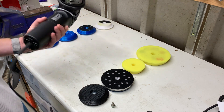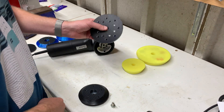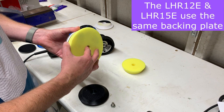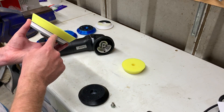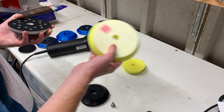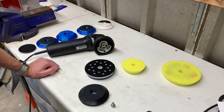About three or four months ago I picked up this Rupes polisher LHRI 12E. That comes as standard with a five inch backing plate, and this is the pad that fits that. It might be five inches, but by the time you're looking at the face there, you're at six inches. What that basically means is if you've got any small areas of the car or panels, it can be a little bit difficult to get in there with the pad — it does, like most dual-action polishers, stall a little bit.